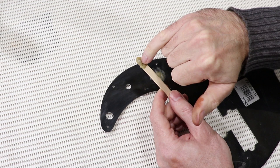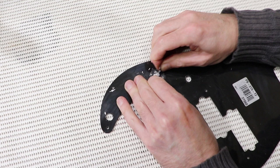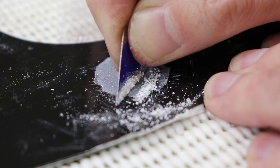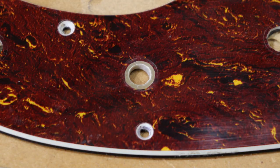Top tip — hang on to your stirring stick. That way you can check that the resin is cured, and this is fine. To level this out I'm going to take the high spots off with a chisel — there really aren't many to be honest. Then I'm just going to scrape it back with a Stanley blade. The idea is not to get it totally flush with the back — you really want it just proud of the back. That way the area you've filled around the hole will actually reinforce the fill itself. With this sort of thing I prefer to drill it undersized and then creep up on it with a reamer.